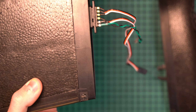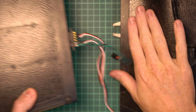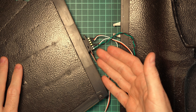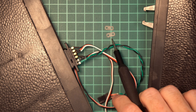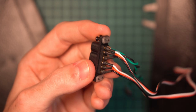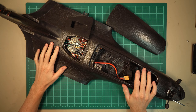That means the actual engagement distance that TBS used for this connector is only 1mm. So if the wing separates from the fuselage by more than 1mm, the servo signal will disconnect. To me this is a design error and must be corrected. I designed and printed two spacer parts that position the connector on the main fuselage or wing closer together so they connect properly. You can find this part to download in the description — print it and put it behind the connector on the fuselage to add the missing 1mm of engagement.